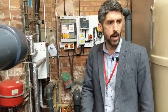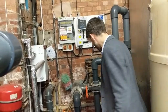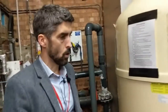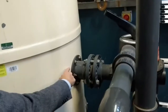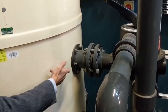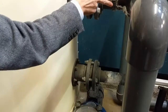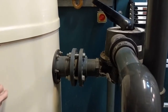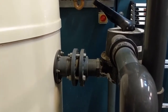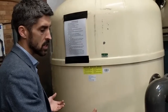The backwash has been running for about four minutes, so we'll turn the power off. Following a backwash you do what's called a rinse cycle. What happens during a rinse cycle is water goes in at the top as in normal filtration and comes out at the bottom of the filter, but it still goes to drainage. The purpose of the rinse is to re-compact the sand bed inside the filter, because for the past four minutes we've been agitating and fluidizing the sand bed. Rotate the multi-port valve round to the rinse position.